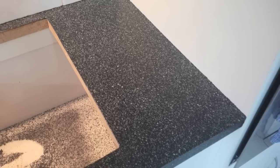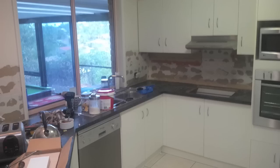Wait for the full two-week cure if you're going to put two coats on, then you're right to use it. After two weeks I came back, removed the daggy tiles that were on there, and retiled the splashback right around to the edge of the kitchen bench top on the left. When you pull tiles off you often destroy the surface underneath, which in this case was just gyprock — it might be blueboard depending on how your house is built.